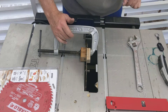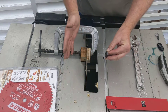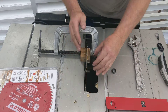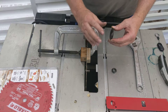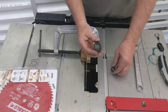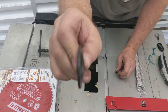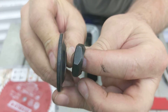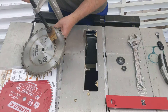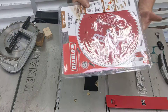There is a certain way the nut goes on. The nut has a flat spot on it that goes against the washer — you wouldn't want to use the cone side against it. Next comes this cone-shaped washer, which basically spreads out the force of the nut onto a wider surface area of the blade. You want that wide area against the blade, and the flat spot of the nut rides on the smaller part of the washer. You can see the washer also has a cone shape. Now I can lift this right out, remove the C-clamp, and take the old Diablo out — these are pretty good blades, I've used them before.